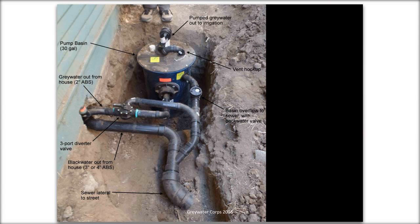On this slide, you can't see it, but there's a flange on the top of the basin where the basin is about 18 inches in diameter, and then there's a flange that sticks out, so it's about 24 inches in diameter. On the bottom, there's a similar flange, and there's an important reason for that. In wet environments where the ground is going to get totally saturated, if the water table rises up, the basin itself can uplift. If anyone has ever tried to hold a basketball or a beach ball underwater in a swimming pool, there's a tremendous amount of force that water can push up an empty basin.